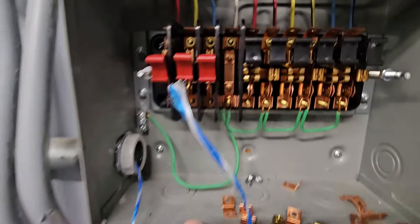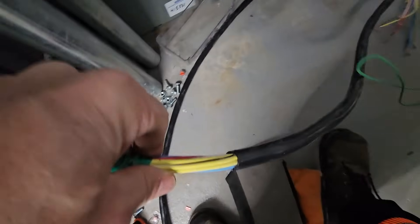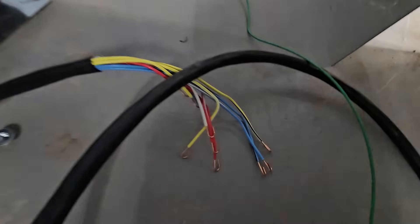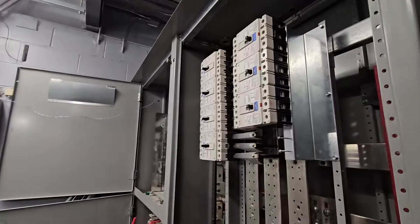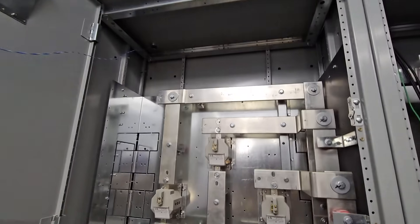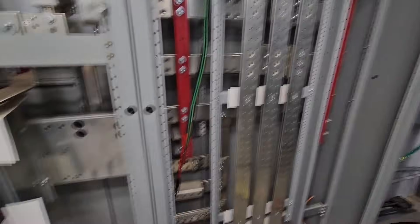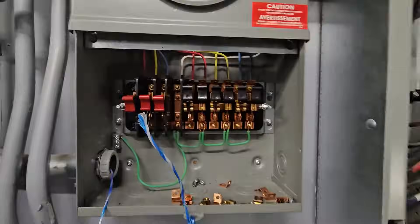So I've got everything ripped out now. I taped up the old wires, pulled them back through the pipe, and pulled through just a pull line in case - it's quite a run. There were I think three or four 90-degree bends between my test switch and that cabinet, so I don't want to try to shove that through by hand. When I pulled that back out through, I did make sure I had the line pulled through, although we were probably going to move that location anyways. Better to have it there than not; the end plan was to have just a short pipe going straight across.